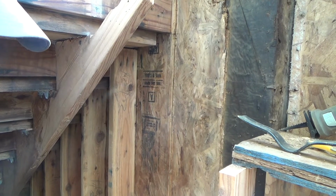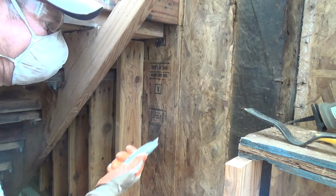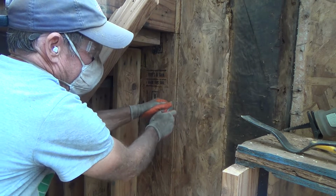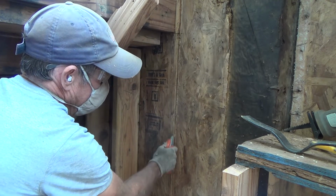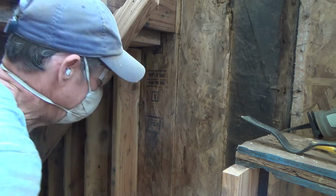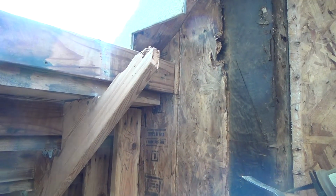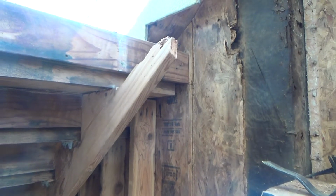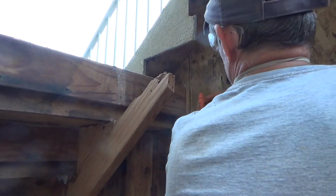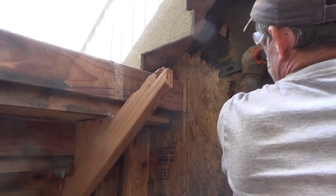I didn't do any of the things I said you could have done to cut that. This wasn't hard all the way, so I took my sheetrock knife, it's all dull now, and I scored it, and I kept digging it out, and digging it out, and I made a line in there all the way down. It's not going all the way, but enough to probably get this to score off, break off right there. See, that was pretty bad stuff.